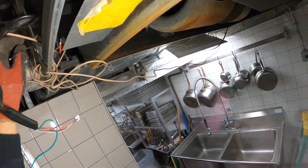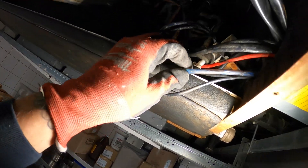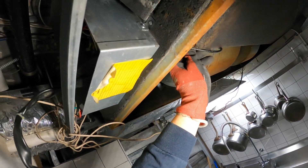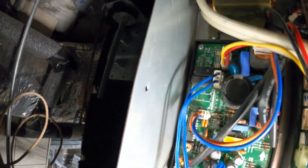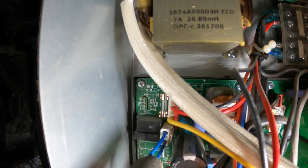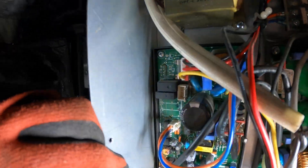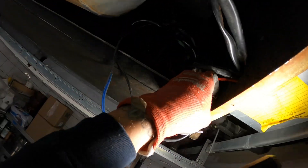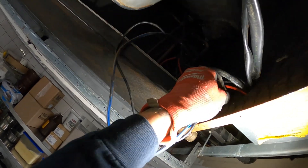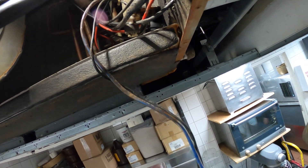And then this one is a clear with the blue — and there's actually water in here. So let's see which one that is. I'm going to do this plug. It says 'CN-D pump' on the board. There's a little clip and I can unplug it — barely fit in there. So let's start by pulling those wires out. Two wires disconnected. The outlet of the pump disconnected.